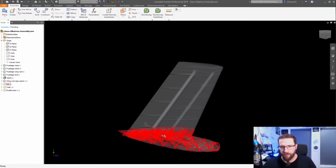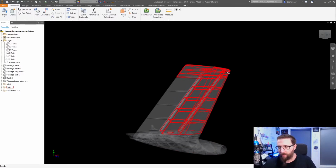This is for a couple of reasons. When you're inserting the carbon fiber rod, it's very easy for the rod to not go in the hole and bump into the side of this rib section, actually crack it, break it. That's very delicate. So just having that tube to guide it really helps. It also helps distribute the forces from the ribs to the rod so that you don't end up buckling these ribs when they're trying to press the forces onto the rod in a certain spot.